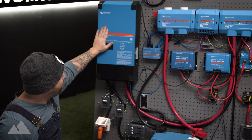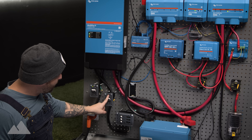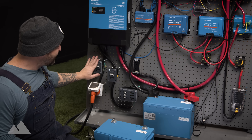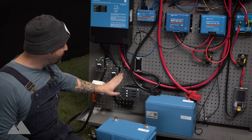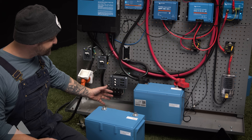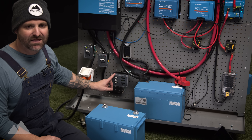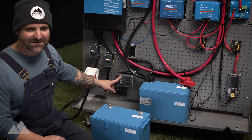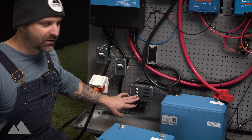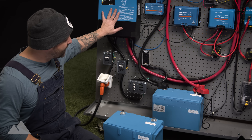The power is then going to come out of here in 110 and it's going to go right into a 110 breaker. We have a breaker here and a breaker here, and then this is for your outlets — you have the option of three. For most overlanding vehicles, you're not going to need that many breakers on the 110 side. You may only have your hot water heater if you're going electric on its own breaker. That pretty much sums up this electrical system on the 110 side.